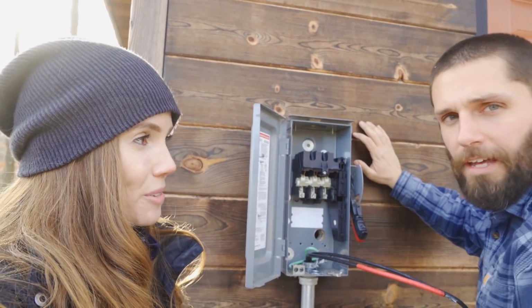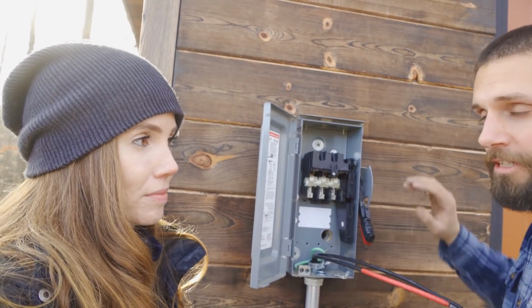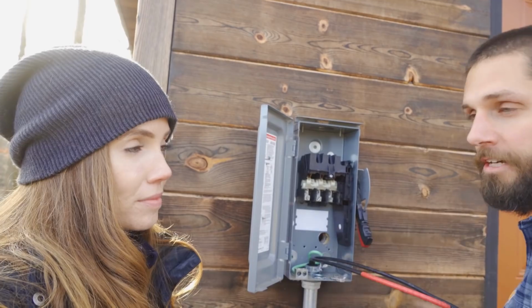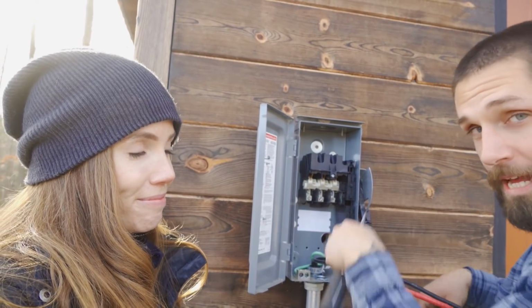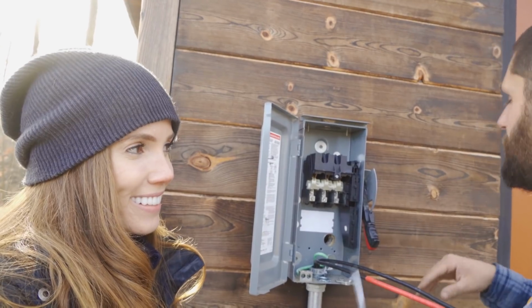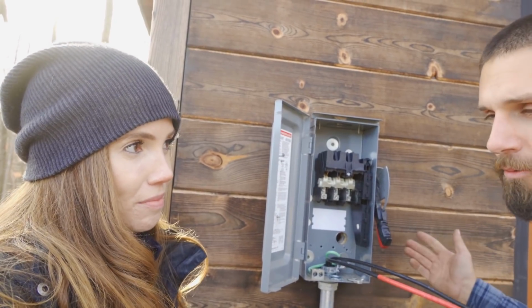Our plan is to put a trough down here. Regardless, we have to do that because we have 1 pipe coming back with 2 different strings. So it's going to go into different disconnects, and I need a way to separate that pipe to go to 2 different disconnects. So I'm getting that done regardless. Right, with 2 more disconnects. So we might as well pull this down, put that same pipe into the trough, and make it all nice and neat. Pretty. And potentially get it ready for 4 disconnects. Yes, not 3, just in case we put another one on down the road.